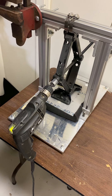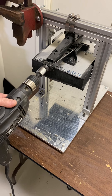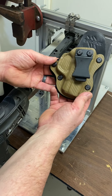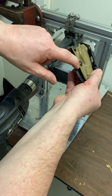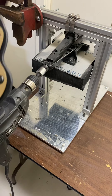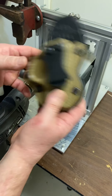So when I pull a sheet of kydex out and I have a mold — like a mold gun — most of the projects I work on are holsters that I call hybrid single clip. They all have an offset washer or a bushing right here. So when I do a mold on a particular gun, I'll incorporate this offset so that I have full adjustability all the way around the holster itself.